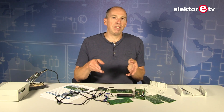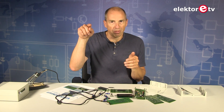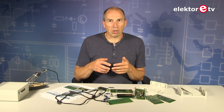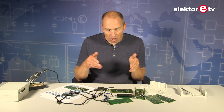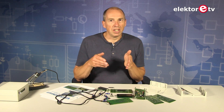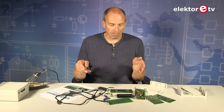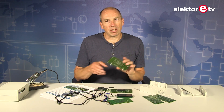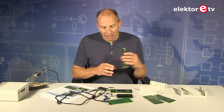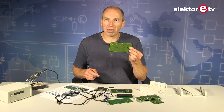The software integrates nicely with the Arduino IDE — you copy the software into your Arduino setup and under Tools > Board you should see all the Platino variants you can use, with the processor listed next to each one. This is important because for every different AVR you have a different bootloader — you cannot use an ATmega168 bootloader with an ATmega1284, for instance. So you pick the processor that matches what you put on your Platino. Now that you know how to configure Platino, you can build your own soldering station and configure your next Platino board for our next project. Have fun!